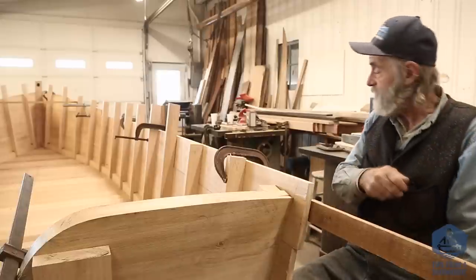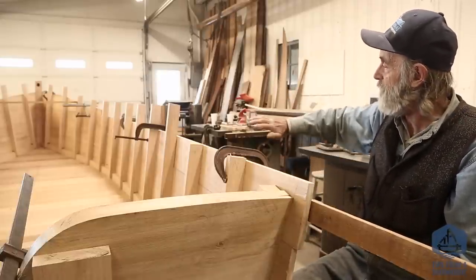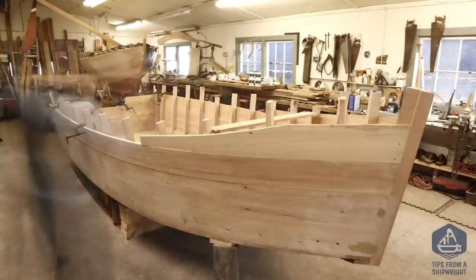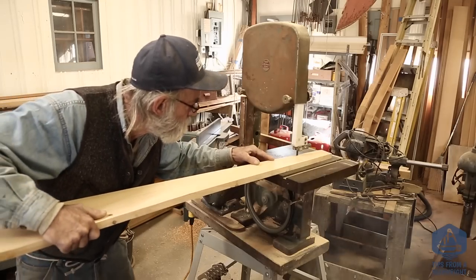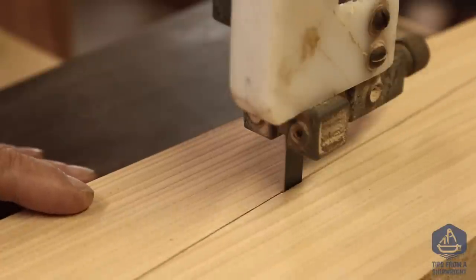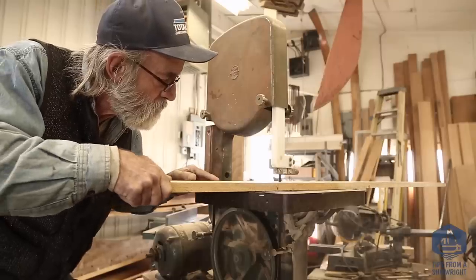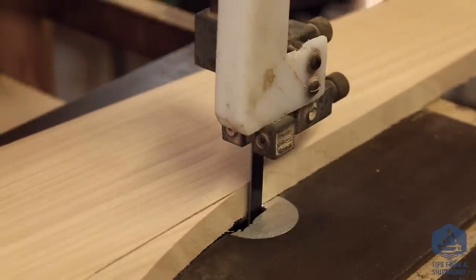Now the next thing for us to do is to strike that pencil line the full length of the hull because we've already arrived at the whole shear line, and then remove the batten and start cutting it. Now the piece up forward I'm going to remove and take it right over to the bandsaw and cut it on the bandsaw because I can. It's not too long and weighty and I don't have an outfeed table on my bandsaw, so I can't cut the whole shear on it but I can certainly cut this piece. I'd cut everything on the bandsaw if I could - I love bandsaws.